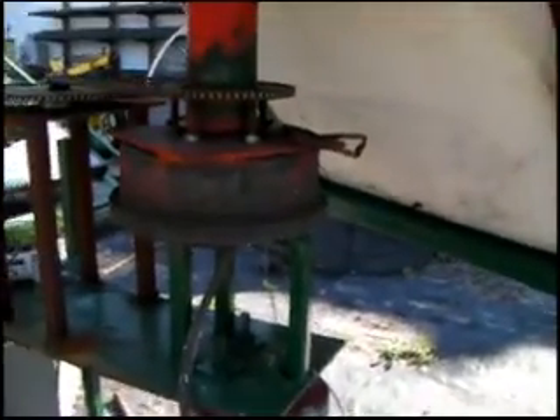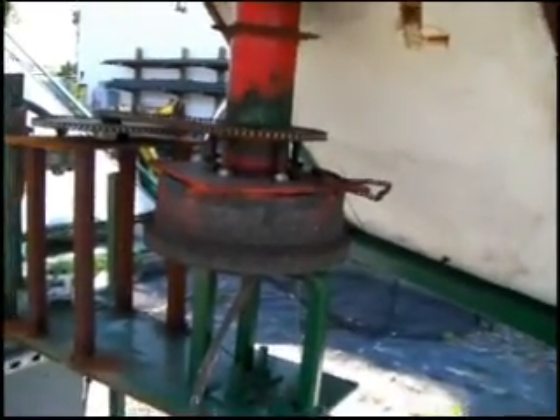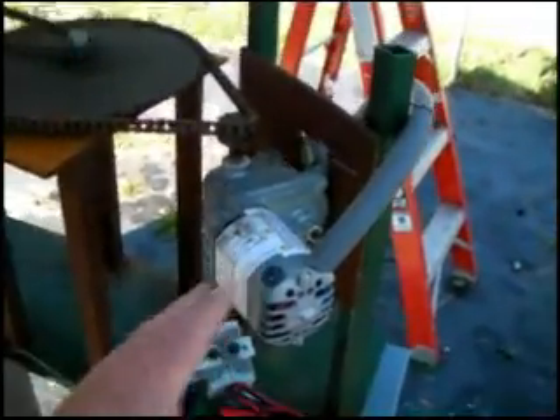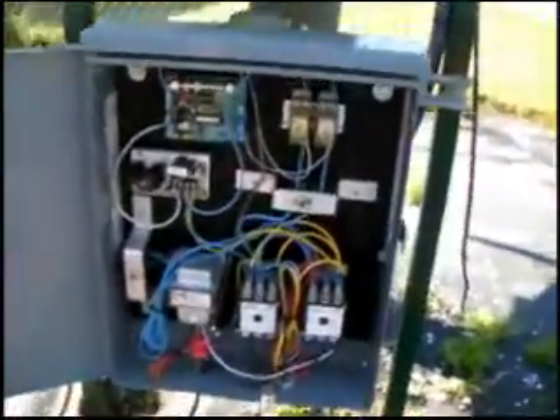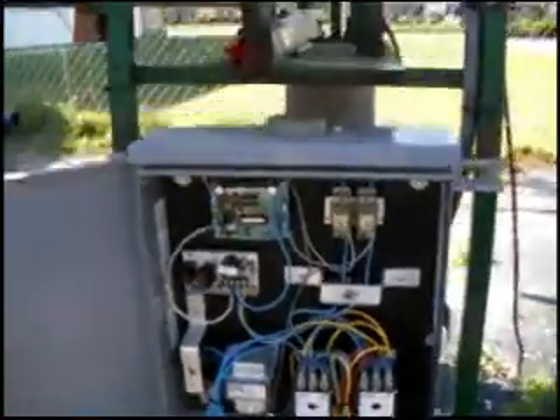Okay, come around to the backside. It pivots — this is a front hub assembly, brake drum assembly off of, I think, a '61 Chevy II. We've had to do some reduction gearing on it. This is our electric motor — a 120-volt motor with some gear reductions. We can easily put it on a photovoltaic system with batteries; this uses very little power to actually make the unit work. This is some of the control systems on it. The apprentices did a pretty good job — we could probably condense a lot of this down, but I think they did a good job.